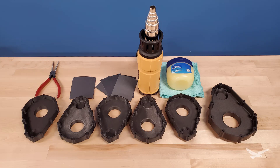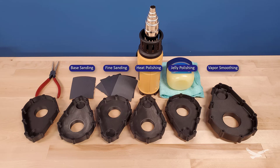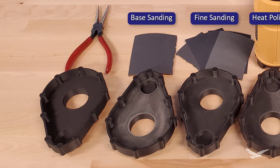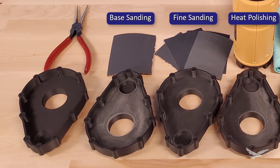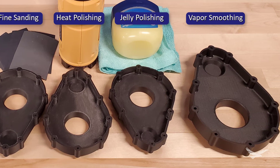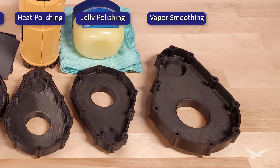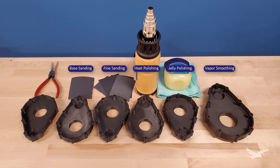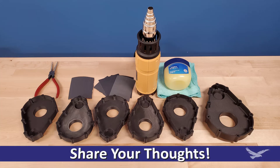If you're still with us, I appreciate you taking the time to watch this full video. We went over a few examples and options today, and while the focus was purely on supported areas, you can definitely use any of these on an entire part as well. Each one has its own advantages and disadvantages when working with Markforged parts, and personally I think a combination of sanding at finer grits and then either heat polishing or petroleum jelly polishing would be a great option. Let us know in the comments which one looks best or that you'd prefer to use based on your available time. Feel free to share other post-processing methods you prefer, and subscribe if you want to keep up to date with content like this. Thanks again everyone, and we'll see you next time.